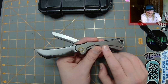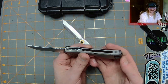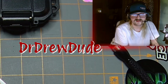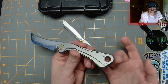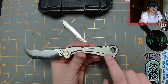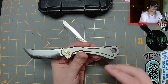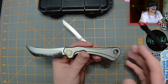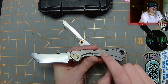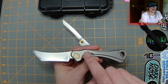If I were to modify this, I would anodize the titanium handle to be another color. I'd probably use a power supply to just get an even color coat. I could lightning anodize it. But also, what you can do is you can take nail polish to do kind of like a design, and you anodize one color, and then you take the nail polish off, and you anodize another color that's a lower voltage, so it doesn't change the higher voltage color. You kind of do layers that way. You can make some really interesting artwork on these things. So you see how it's raised 3 different levels? That's what you could do. You could change these to each have different colors.